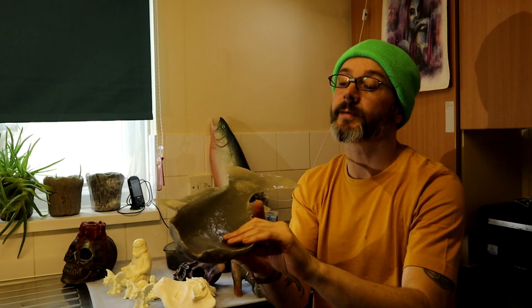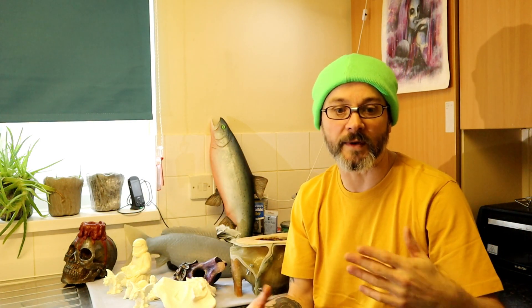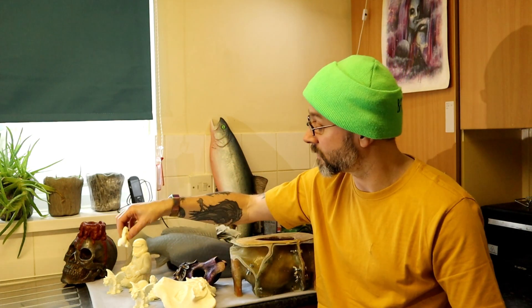If you're using casting resin you can also pour it in stages — let the first stage cool off, then add the next bit and so on. For big items I'd just build the shell, and if you want to add weight, fill it in with something else like concrete. Or if weight doesn't matter, you could fill it with expandable foam. Whatever your project, research the materials suitable for it. Starting out, begin small and get used to how your materials behave.